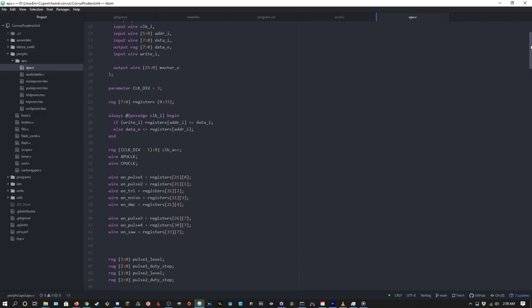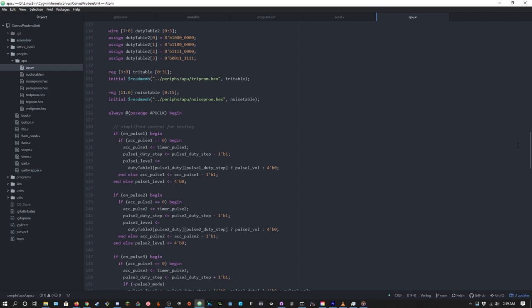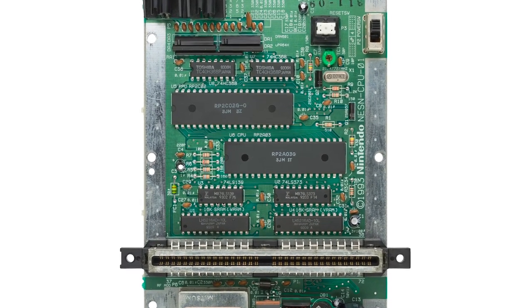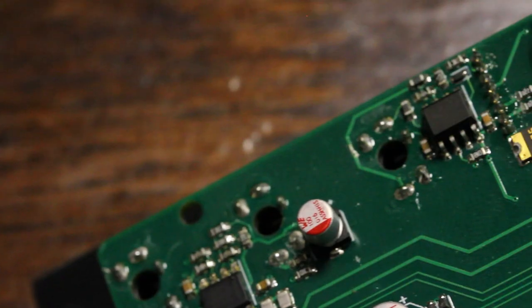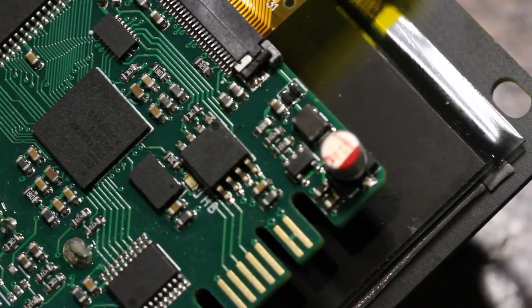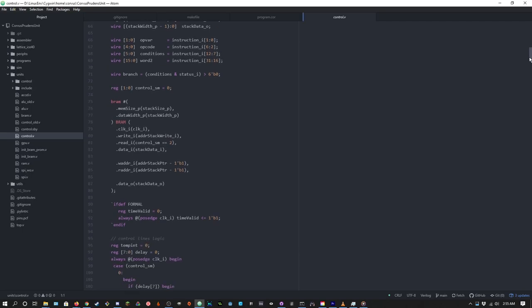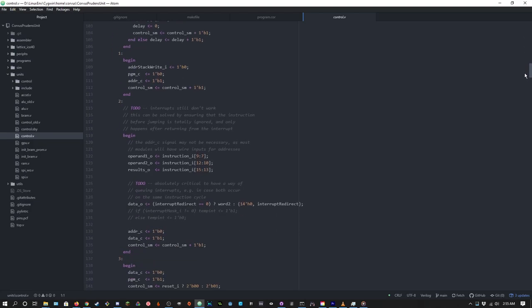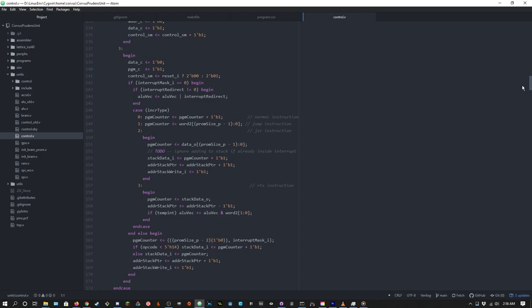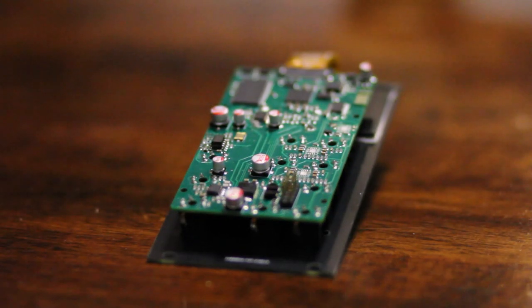The audio logic can't drive itself — it needs some sort of manager to load notes and manage musical effects. In the NES, the audio chip was connected directly to the CPU which handled all of that. So it was time for me to design my own CPU. Designing a CPU can seem daunting, but they can actually be quite simple. My CPU only supports a subset of general-purpose CPU features, and I haven't even added division yet. At 16 bits, it's somewhere between an Arduino and an ESP32, but it only runs at a measly 5 MHz — not great in terms of FPGA or dedicated processor performance.